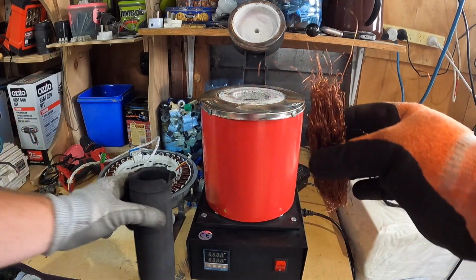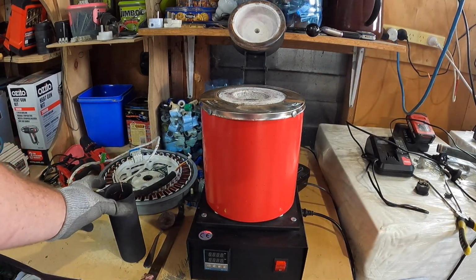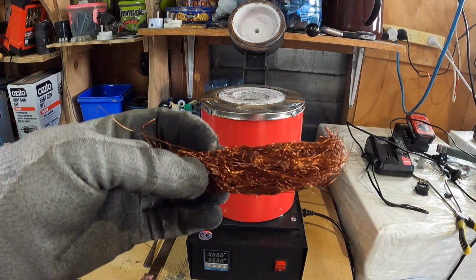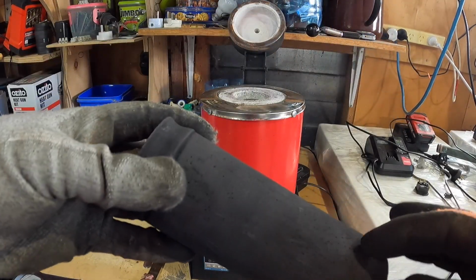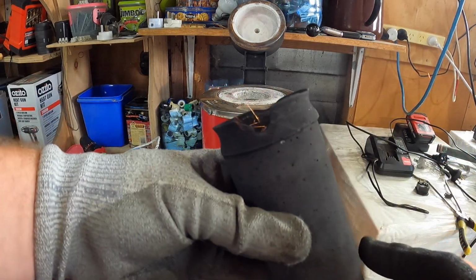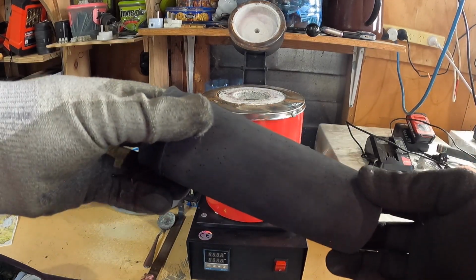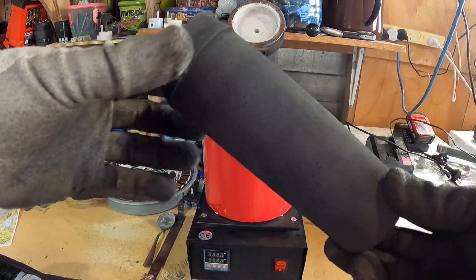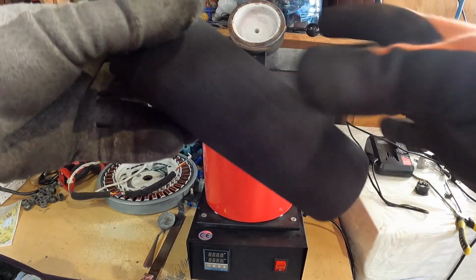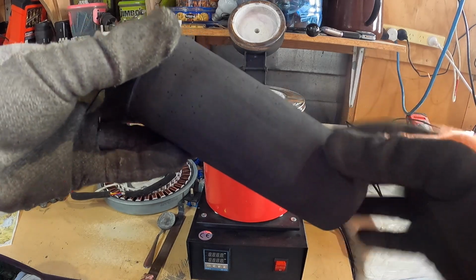I don't have an example, but on the inside of the crucible there, you can see it's a lot darker than on the outside. I used quite a bit of this to melt because this is all I had; I didn't have any nice shiny copper to melt, or any of this grade 2 stuff, and I think that's what's caused this pitting. For some reason it's just eaten into the crucible, and it's worn the crucible away, something chronic, because I fear that these don't get up to the temperature of, say, a Devil Forge or LPG or propane powered furnace, so it doesn't burn all the impurities away because it doesn't have the heat. And so there's a chemical or atomic reaction at the top of the furnace here at the crucible when it mixes with oxygen in the air and creates all of this problem.